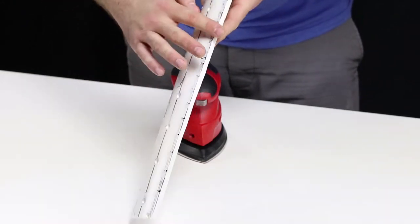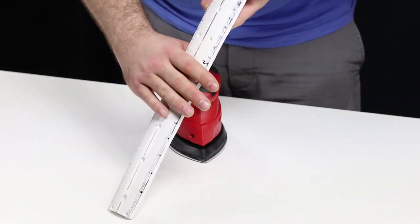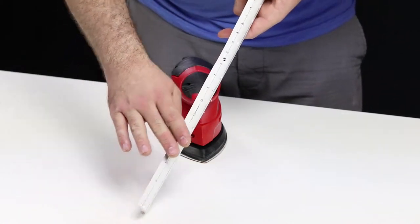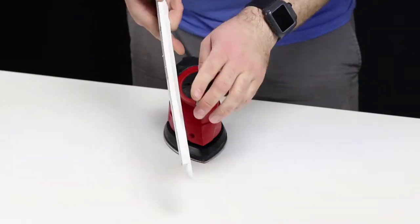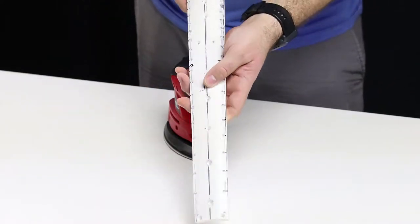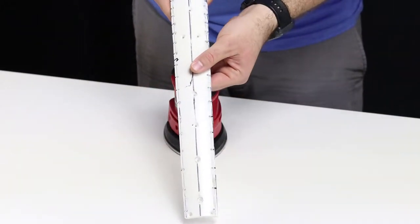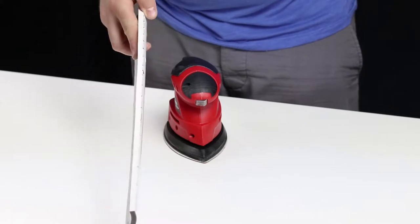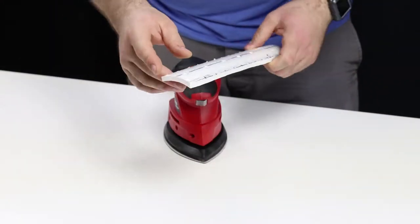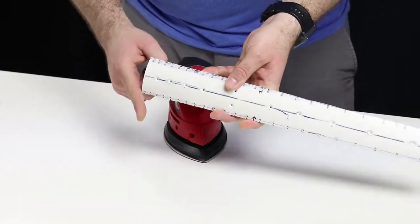Now primarily the ones I'm worried about are the edge where it breaks from the top of the fingerboard to the side. That needs to be perfectly round and smooth. Now the edges that are along the sides of the fingerboard I'm not so worried about, because I'm gonna fill that in with wood filler to mate it to the neck. But I will round it a little bit just for good measure. And then the back, I want to round that edge off as well.